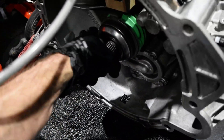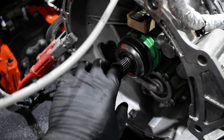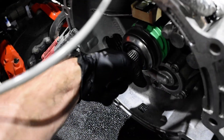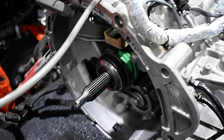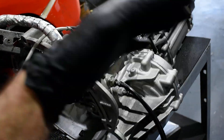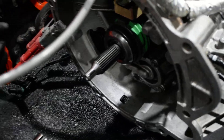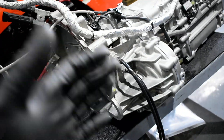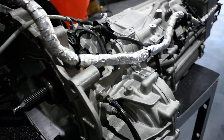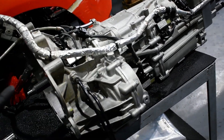It's not letting you start the engine. You might ask why you can't turn it by hand — it's because it's not consistent. You have to make it again. When it starts shifting, you put neutral first, neutral reverse, neutral second, neutral third — you need some speed to do this. It won't let you start the engine if you don't complete the transmission adaptation, because it needs to know if two gears are engaged at the same time.